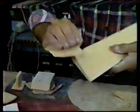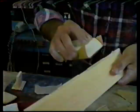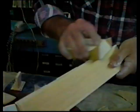Always catch the edges. Those edges, if you don't get a nice radius on them, what's going to happen is, as soon as you put the colored paint or the silver on it, you'll sand right through the edge and you'll have an eyesore sticking up looking at you. I see I've got a little edge here I have to catch with a block. And even though this will be on the bottom of the airplane, and I'm sure nobody will ever see this, we want to get it right. Just in case Ski Dombrowski's looking, or Joe Reinhardt or Stan Powell or somebody. They can't go, there he is, he screwed up. Well, now you know I screwed up. You know I'm covering it up.